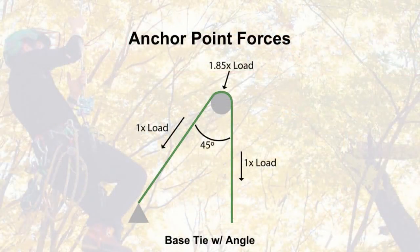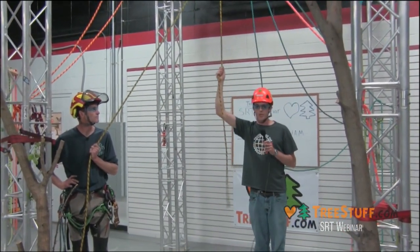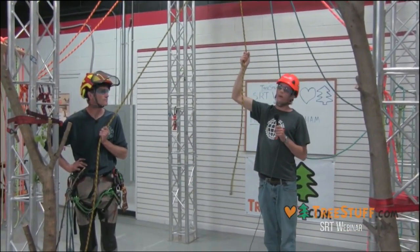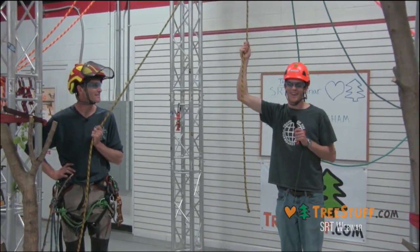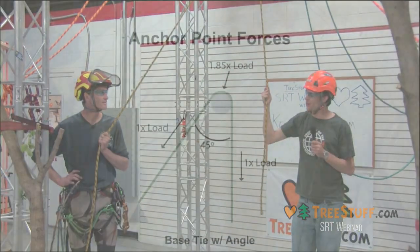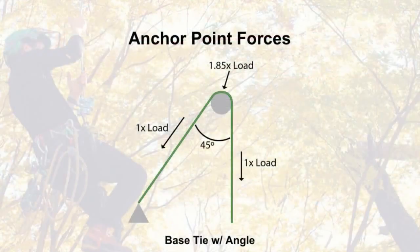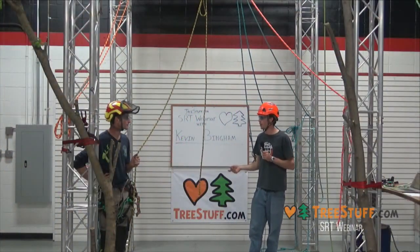So we know that if you come over here, you are my base tie, and I pull down right here with 100 pounds of force. Does anybody on the internet know how many pounds of force it was going to be without looking at the presentation? I wouldn't have. I had to do the math, but at a 45 degree angle, it's 1.85 times the load. So if I pull down with 100 pounds of force, the anchor's only going to see 185 pounds, not the 200 that we saw before, right?